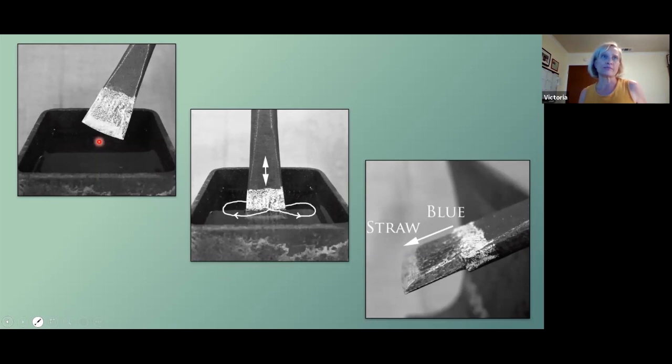And it's a little past, some people, I've heard a lot of people use, oh, when it's no longer attracted to a magnet, then you're done. No, it's just a little past that. So take it up to this temperature slowly. You don't want to burn your tip off. You want to slowly ease this into that darker red, barely orange color. And then you're going to quench it in water.